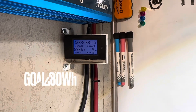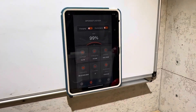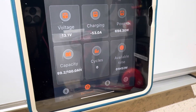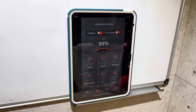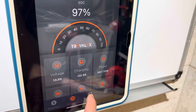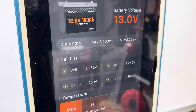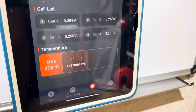The load has stabilized. We are at 54 amps coming out of the Truvelux battery, right around 700 watts. Going over to the app, they've got an available time remaining of one hour and 52 minutes. The capacity is already moving through — 53 amps reporting, 695 watts. Still near the start of the test, still showing 97% state of charge through the app. Looking at the cell voltage deviation page — not very much deviation at all with the battery loaded. Battery is at 81.7 degrees right now. Decent little app.